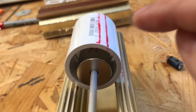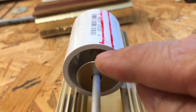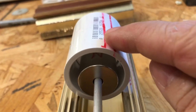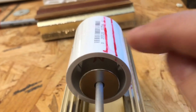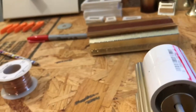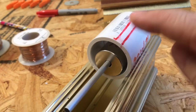All that matters is that we get the timing just right, so when these fields of north and south are in the right position, we energize this with the opposite or like polarity to kick it around. The whole thinking is this, as long as there's no fallacy in my thinking: these three coils — one in the front, one in the back, and one wrapped around this.